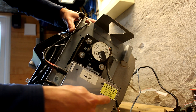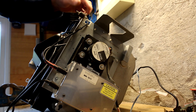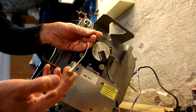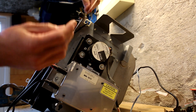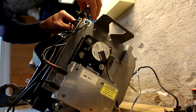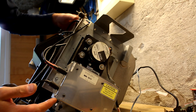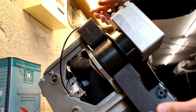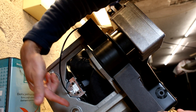We can notice here it has a caution: after use of the brush, fix it in the parking position. This is what I found in part 1, which is this wire with a small brass knob that you can pull all the way out. It seems to go all the way back to between the rollers, where you would imagine that the laser beam would meet up with the fiber optic going back to the PMT. At the other end of the cleaning brush, we can see the wire going down and it goes in between the two rollers.